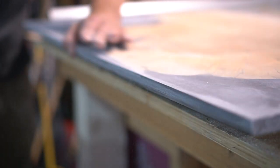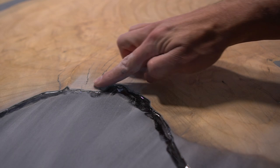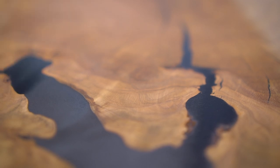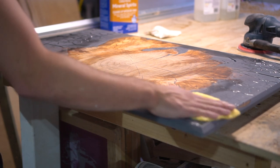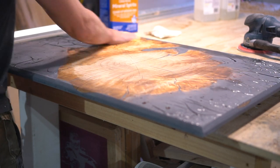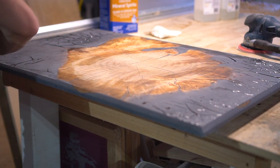We actually had a bit of epoxy suckage right in one corner - that wood was so dry it sucked up the moisture of the epoxy while it was drying, but that's not a problem because we're going to be doing a flood coat. I wipe down all the surfaces with mineral spirits and a clean lint-free cloth. After that dries, I take a tack cloth over the entire surface to pick up all the miscellaneous particles that the mineral spirits couldn't get. This is a very important step since we're pouring a flood coat and any particles not picked up will float within our epoxy.